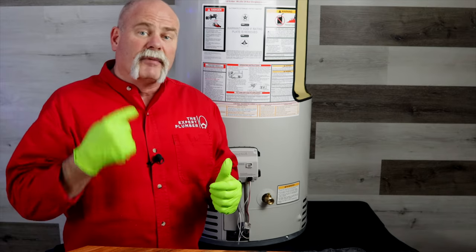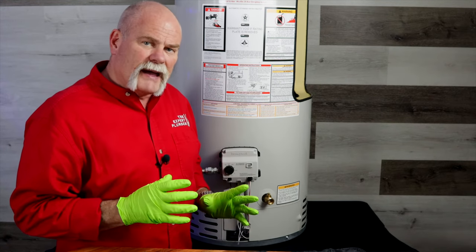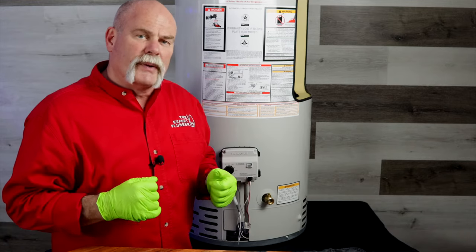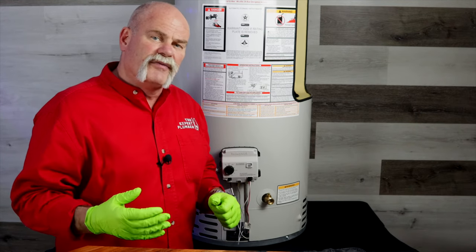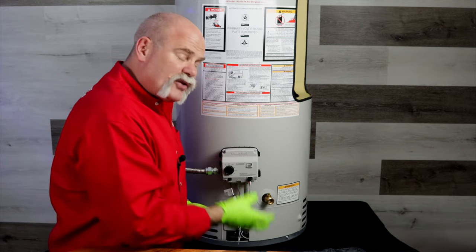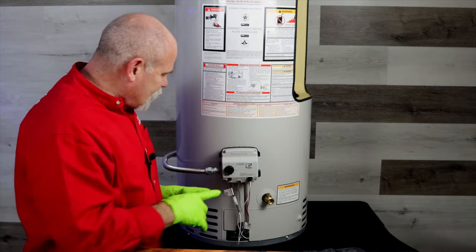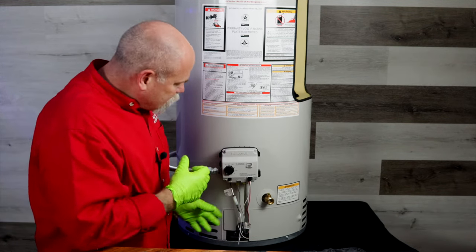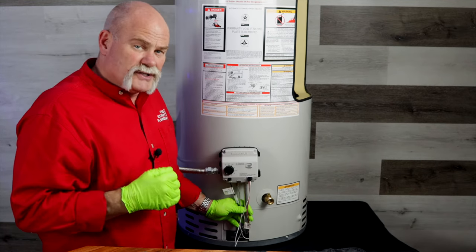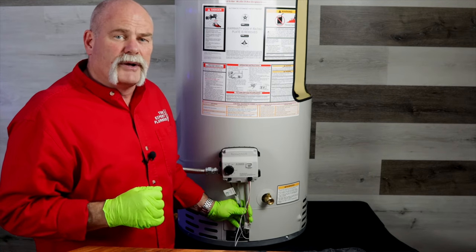Things to remember: make sure you turn off the gas valve before you start. Be careful putting everything back in. If the felt around the burner assembly door needs to be replaced, make sure you replace it. Chances are if you've got a new burner assembly, it's going to come with new felt — make sure you put it on so it seals off properly. Never take out that sight glass. I've heard of people taking it out to let more air in to help it burn hotter, but that takes the safety feature completely away — that is not a smart thing to do. Last thing: after you tighten up all your gas connections, make sure you take a spray bottle of soapy water and spray it all down once the gas is on to make sure there are no leaks. If you leave a gas leak, you can cause a problem in your house that you really don't want.